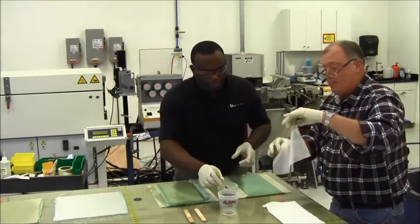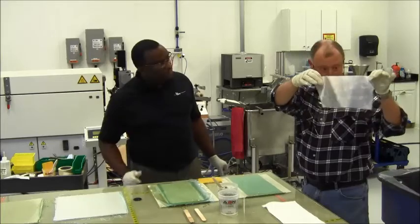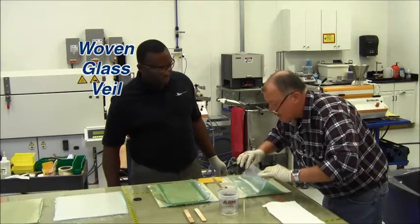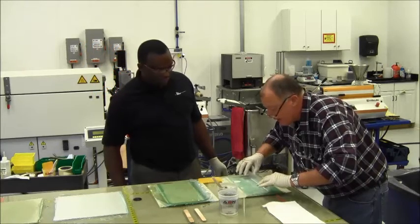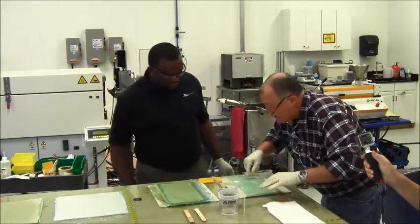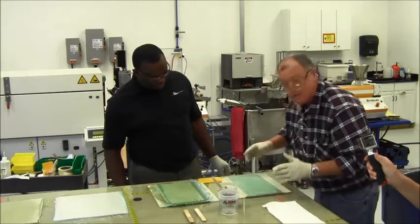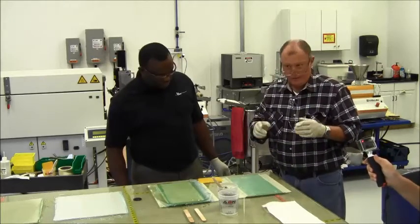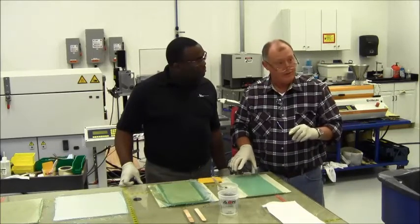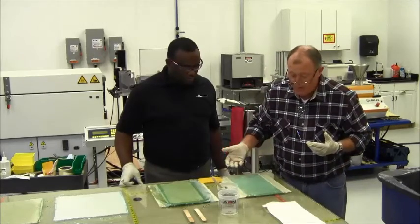Now, unlike the veil that we used before which was a continuous filament, this is a very lightly woven two-ounce veil. I'll put it down and very carefully allow it to lay down while not trapping any wrinkles in it. And as you can see how it so nicely just disappears with the resin that's laying down there. What it's telling me is that I have enough resin in the core material itself to get good bonding to the core, because it was enough to totally make the veil go transparent.